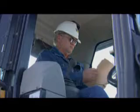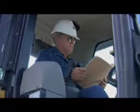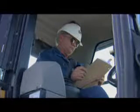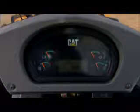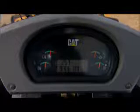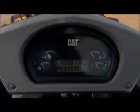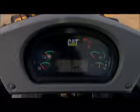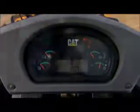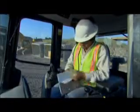The monitoring system has a 3-level warning system. Check your operator's manual to find out what triggers a Category 1, 2, or 3 warning and what to do when a warning occurs. Upon startup, the warning system will go through a brief automatic internal self-test. Display lights illuminate and an alarm sounds. Visually check to confirm all gauges and display lights are working during this test. For complete details on warnings, refer to the Operation and Maintenance Manual.